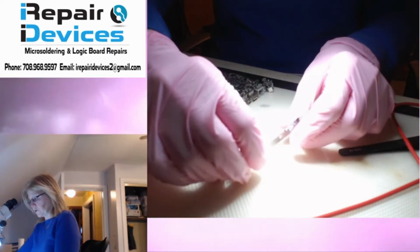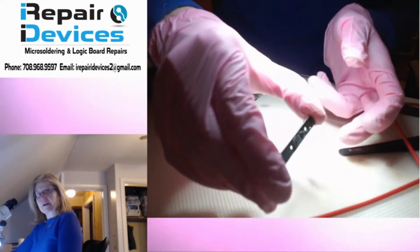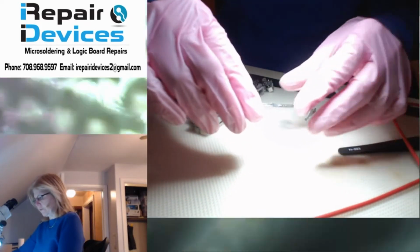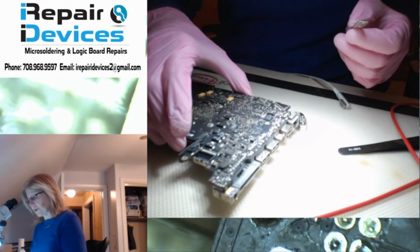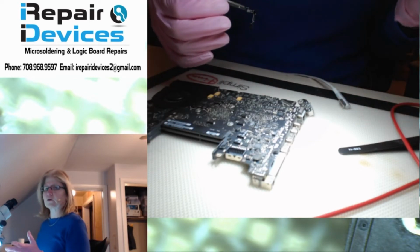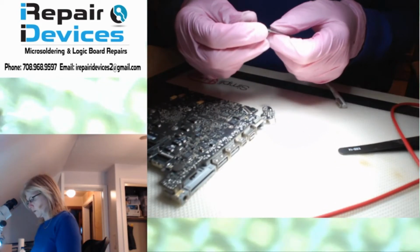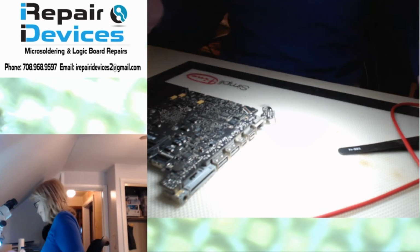It's actually on this little circuitry board here, the battery sensing circuit that sits on the side of the laptop, and it's like the indicator of how much battery you have left. So I ran into, I'm going to say, two other units like this. And the third one, I was missing the PP3V42 line on this actual battery sensing line. But the other two, it was actually this guy that was the actual culprit.